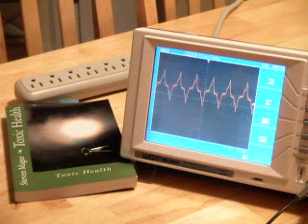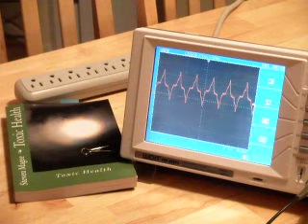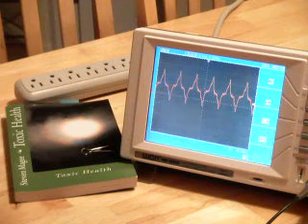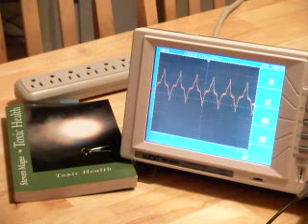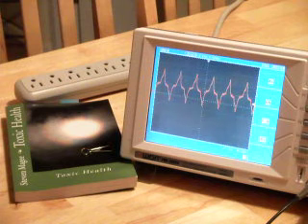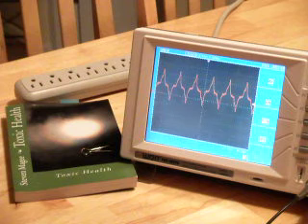The reason that's happening is we're only about 20 to 30 feet away from where my electrical ground rods are. One of the important concepts I'd like to go over is that electrical ground rods in the wrong situation actually electrify the ground. Not only do they electrify the ground where the rods are installed, but that voltage can extend possibly hundreds of feet from the ground rods. So if you like to walk around in bare feet, you should become aware of where your electrical equipment is that is connected to ground, and possibly stay away from it — particularly if you don't know whether the ground is electrified or not.